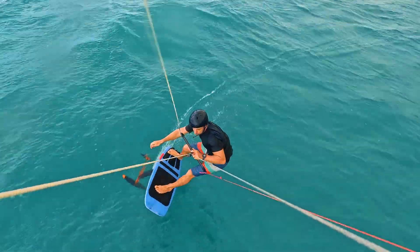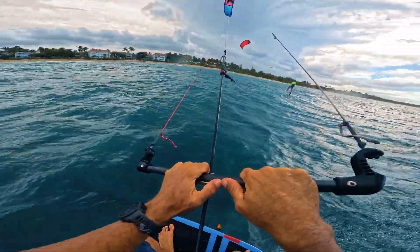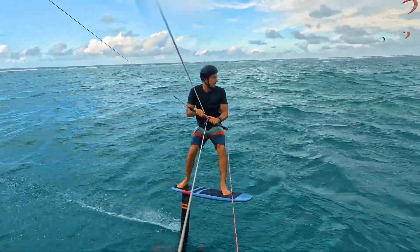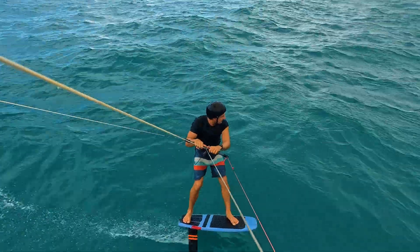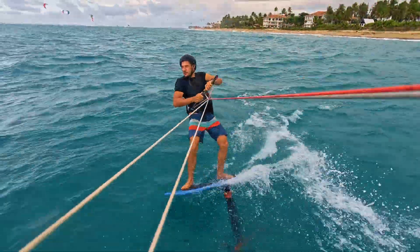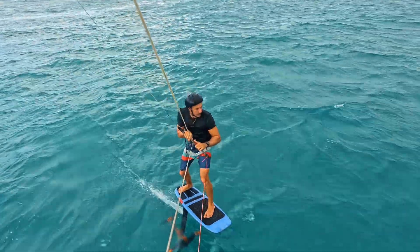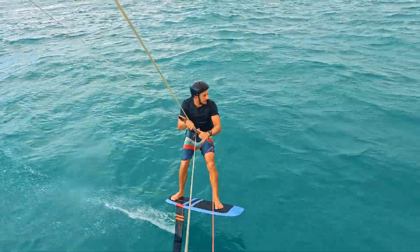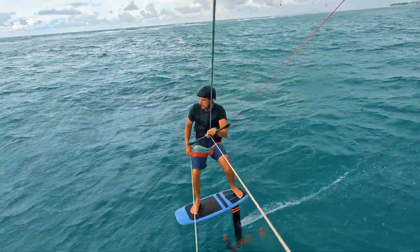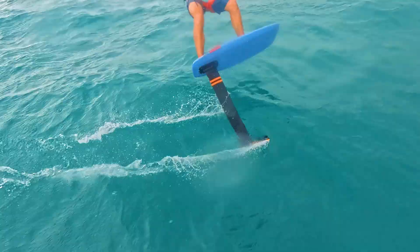Overall I'm pretty happy with it. When I built this foil I made the stabilizer a little bit bigger than my last gliders and gave it a little bit more angle, which gave it definitely a lot more stability. I could keep my weight a little bit on the front of the board during my transitions, and it was more playful in the turns. When I would roll into a turn it would naturally want to pitch up, which helped with the turns. I hope this gave you some inspiration for your own projects, and I'll see you next time.